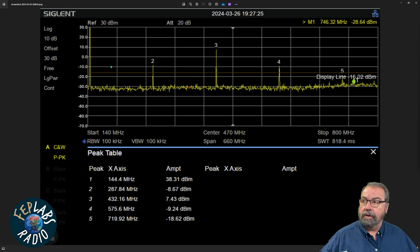What we have here is our five peaks. The first one is our fundamental, and then our second, third, fourth, and fifth harmonics. To pass FCC regulation 47 CFR 97.307E — link below — the harmonics need to be greater than 40 dB below the fundamental frequency and no more than minus 16.02 dBm of output power. Both conditions have to be met. This is a fail across the board. Our second harmonic at 287.84 MHz is minus 8.67 dBm — while that is 46 dB below the fundamental, it is greater than minus 16.02 dBm, which you can see on our red line. That's equivalent to 25 microwatts of power.